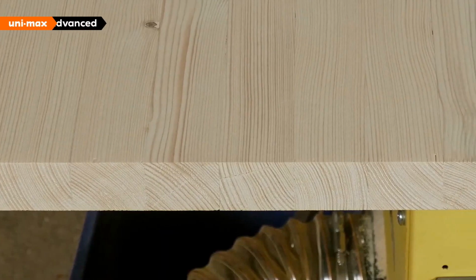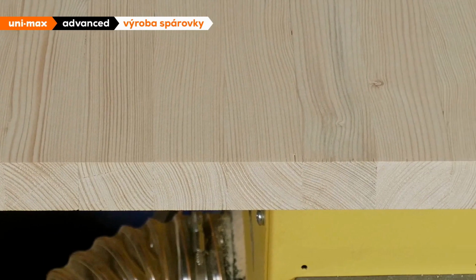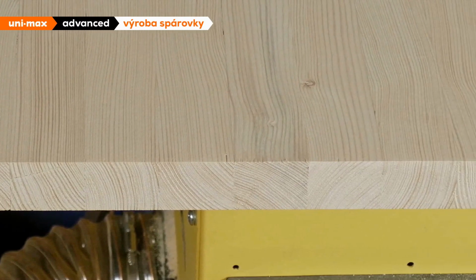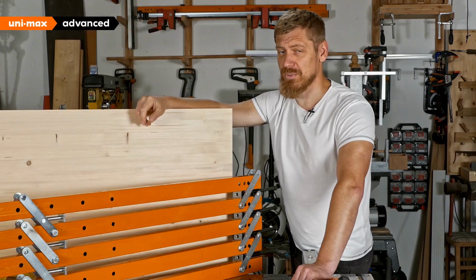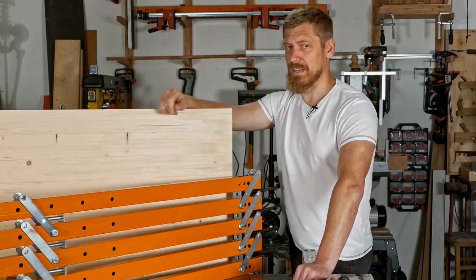The best view of the growth rings is visible in the cross-section, specifically at the ends of the annual rings. Even without deeper knowledge, it is clear how they alternate. We also need to pay attention to the resulting pattern in the surface to ensure that it does not alternate between radial and tangential cuts. Now, let's move on to the actual gluing.